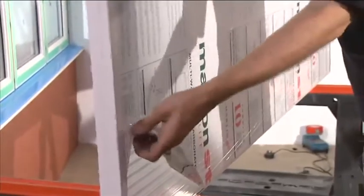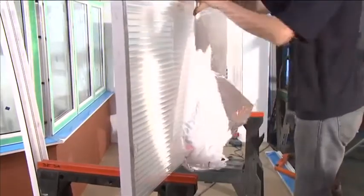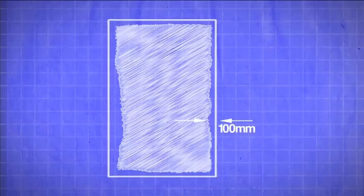Select the first roof glazing sheet and remove its protective outer film. It is recommended that only a 100mm perimeter of the inner protective film is removed at this stage of conservatory installation, as this will help protect the roof glazing sheet from any unnecessary damage. The inner protective film can be completely removed once all plasterwork is complete.